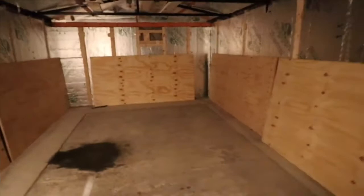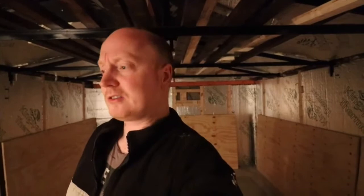So we've got some PVA sealant we're going to put on the concrete floor. I'll just show you where we're at. You will not be able to get all the dust off. However, we're going to put this on to seal it, eliminate a lot of that dust that comes off cement, and then we'll put the floor leveler on top. This should be a quick process, and then the floor will be ready to level, and I'll see you later.